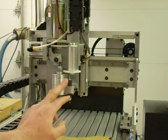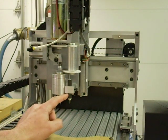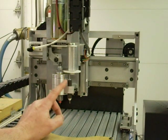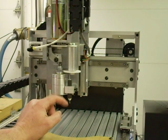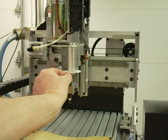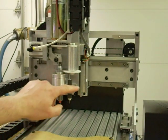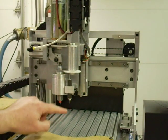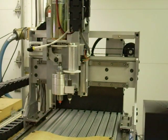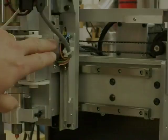Now, up front here, you'll see another thing that sort of looks like a spindle. It's just a special cartridge to hold an old-fashioned ballpoint plotter pen. These are very old ones from an old facet plotter. I just turned up a little cartridge to hold the pen. Inside here is a spring, and then this is a tensioning knob right here. When I want to do plotting, I just loosen this Allen screw, drop it down, set it on top of the paper, tighten up the screw, and I'm good to go for a spring-loaded pen plotter.